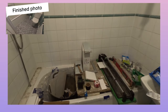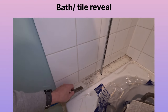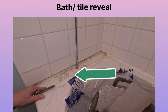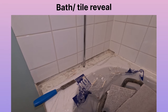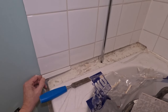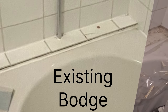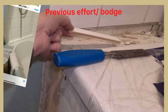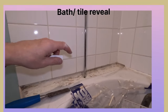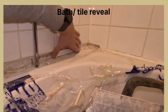So today I'm going to tile that wall, sort this bit out, do the floor, match the toilet up, and try and get the centre of the floor done. You're going to get another level of KERDI board — or JAKO board — 6mm. I'll glue that on, then run a lower level there because the old one was done across really badly. I'll fold it round and tile it down here so you keep that reveal. Then I'll tile flat up to the bath with silicone and tanking paint. The only problem is where they've not brought the tiles down properly and they're all chipped — it's not going to look brilliant, but I'll try and level that a bit with a chisel. They're ceramic.